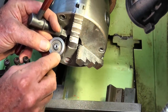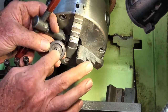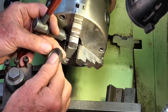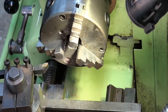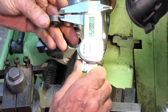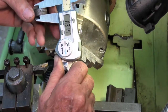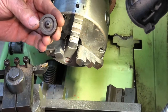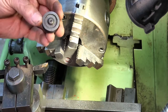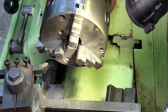There are a few little defects there and the recess in the cast face of the piston is not concentric, but I'm not bothered about that. On the other side, I'm going to take off just the tiniest amount. This is already showing undersized at 374 thou, and it's supposed to be 3/8 of an inch — so it's just really skimming, a thou or two.